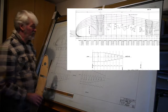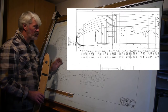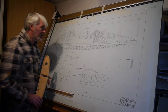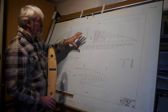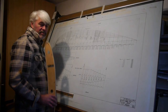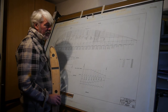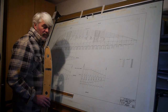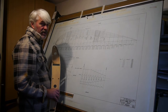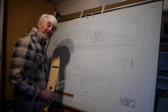Since all those arrows on a drawing would be confusing, we decided to put all the measurements in tabular form underneath. Those who can read such a trajectory plan have all the information required to build the wing. Based on this trajectory, every rib can get its own rib drawing developed from it. The rib drawings then provide all the information required to build the templates, which are then used to actually build the ribs. And this is what we will see today in this episode of Workshop Watch.